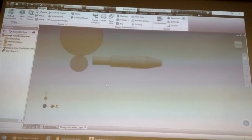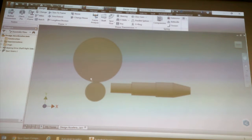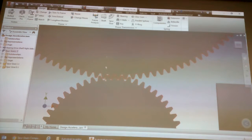So what they figured is, if we went full detail with the gear, we would add, let's say, three faces to every gear. There are 250 teeth between these two gears, which would add 750 faces to the model. Basically, it's going to slow down the model, because anything more detailed slows down the object. So they figured most people don't need that detail, they just need the look.